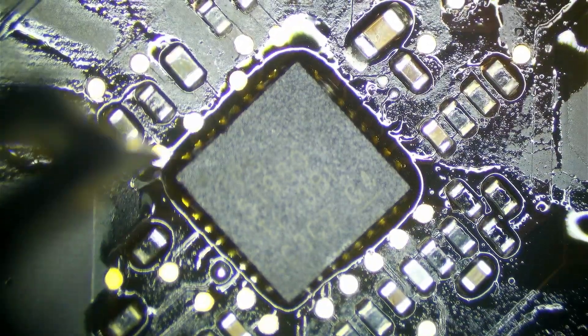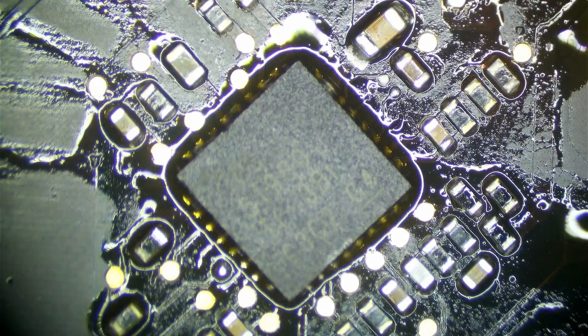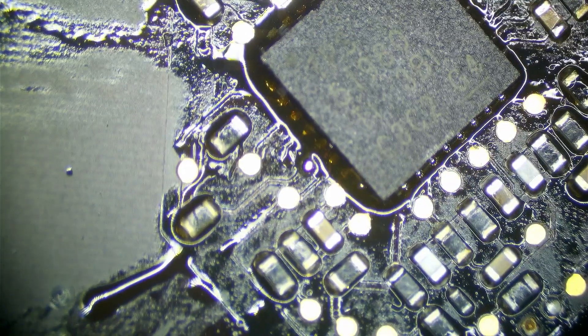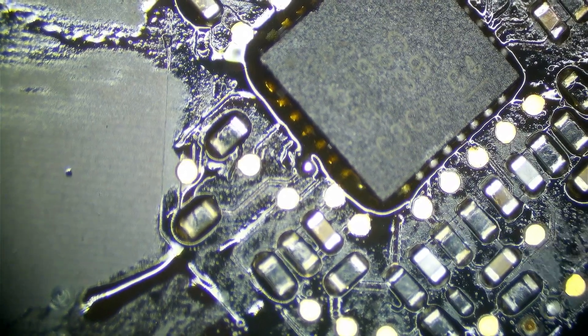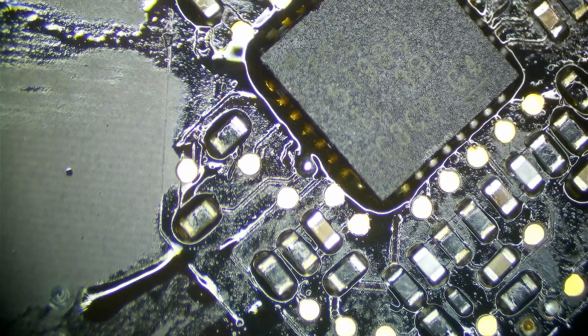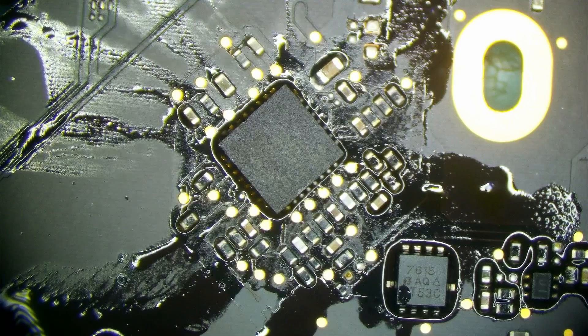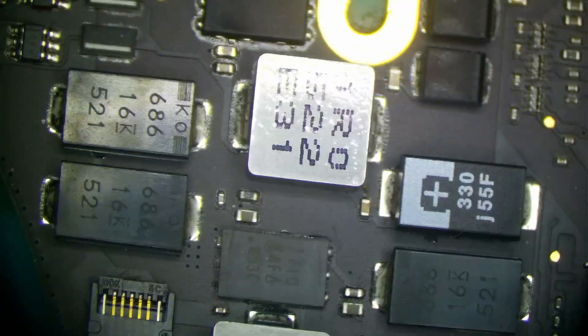The chip is in place and should be good. I don't like to push them down unless I have to, because all the pins look good. If there are any pins that look outwardly bad I'll push them down to re-solder. That does increase the risk of some voiding on the center pad, but a little voiding there isn't really going to be an issue. Let's let this cool down and see what we get.